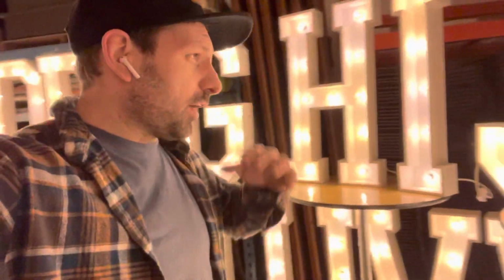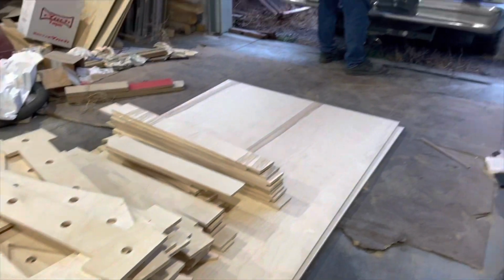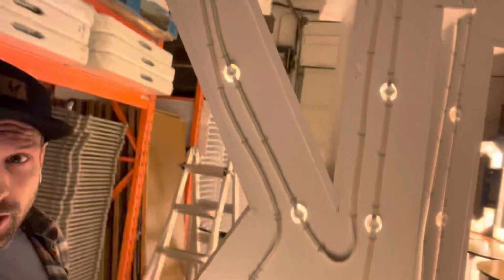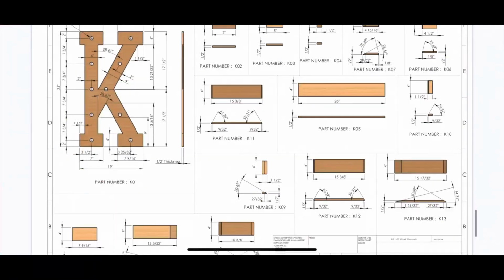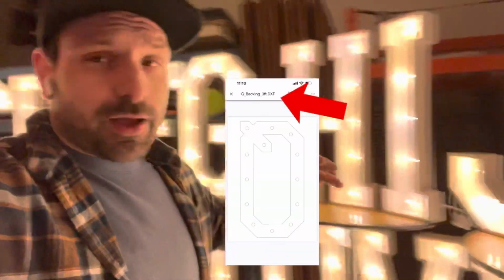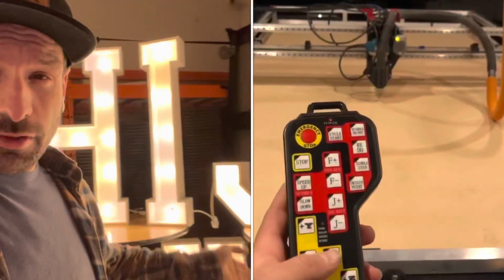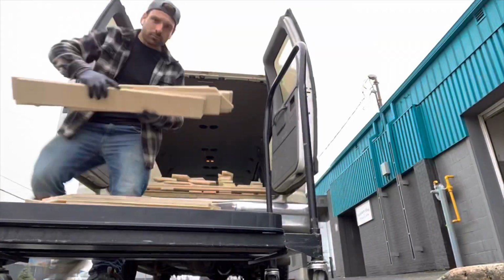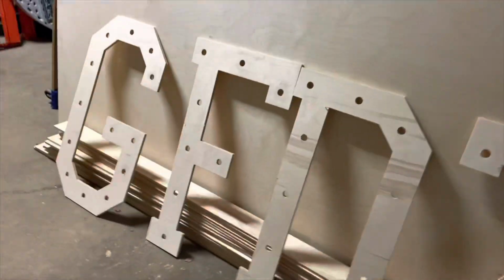First things first, you want to cut the backing. The backing is not this outside part, but the backing wood there. I used 4x8 sheets of Baltic birch, but for my second build, I used 4x8 sheets of 1/2 inch pine, and it worked absolutely the same. We see the lights are attached like that. Pretty simple. We have the PDF files of all the measurements, and there are also DXF files of the backing so you can put them into a CNC wood cutting machine and it will cut those backings out for you automatically, or you could take them to your wood cutter.